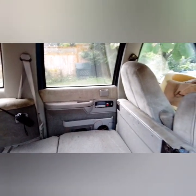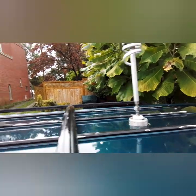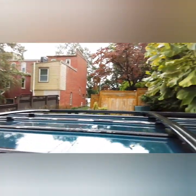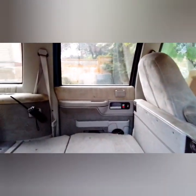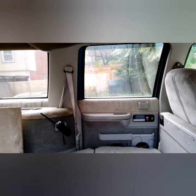From our primary back to our reflector, center of that conductor to the center of this conductor, we have 72 inches. So maybe that distance will work for you, maybe it won't, but it's a great place to start because it works really well on this setup.